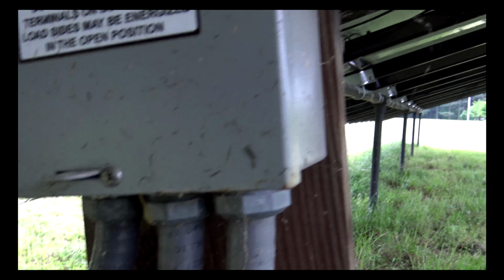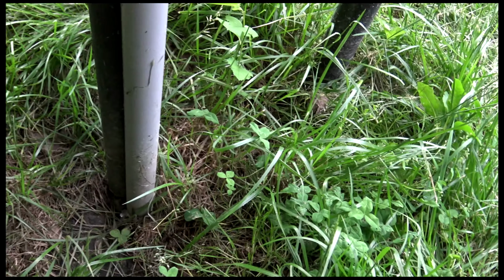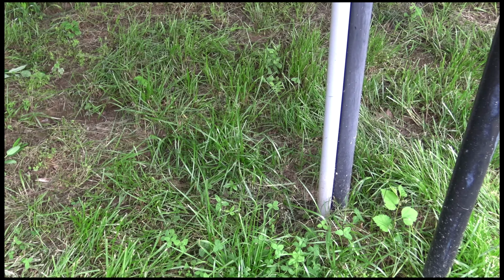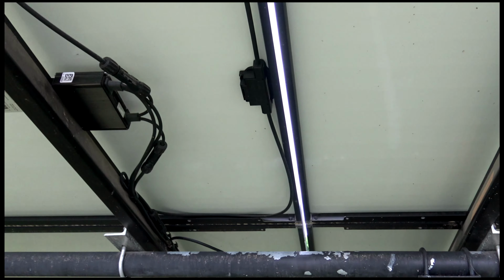and they go into this conduit, and then inside this box they attach here to the 2 DC loops, and then those go down and then over to the structure. So I'm carrying everything in DC, and even though it's 500 to 600 feet, all the signaling works great. The inverter is able to talk to these DC to DC converters without any trouble. I haven't had any trouble.